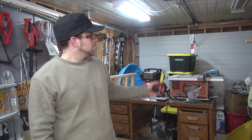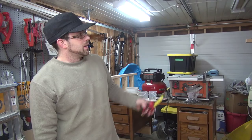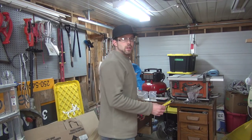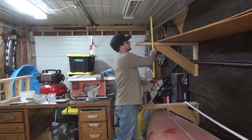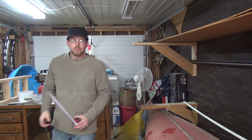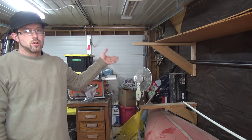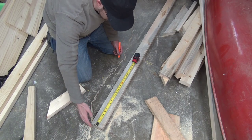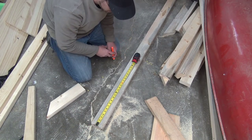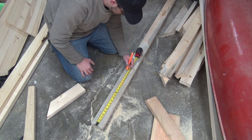Also keep in mind that you may have a garage door that you have to avoid. I had to drop mine down — as you can see, we have about 16 inches from the garage door to the top of the canoe when you open it. The roof where I'm setting this up is 7 foot 9. I've cut these verticals to 7 foot 6 inches and I'm going to drop the rack down about 20 inches from that.